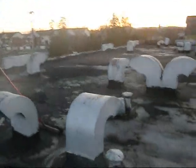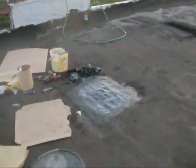There's another one right there, toilets. So, 0 to 1 foot, and the same thing this way. It's going to drain to that side, on this side, because this area here gets all wet, and it's just terrible. And the drains aren't evenly spaced, the vents rather, but I'm going to make them into drains, because the drains now are at that far corner, the other one's at that far corner, and that's freaking ridiculous. And if there was pitch to the roof, but there's just no pitch, it's flat. Generally, a flat roof has a little bit of pitch, just a little bit, but there's nothing here. It just sits here. You get a puddle that goes all the way from there, all the way here.